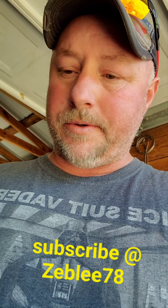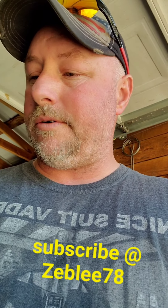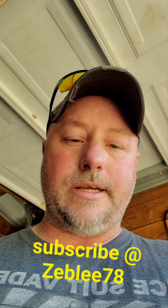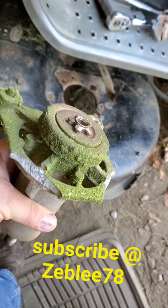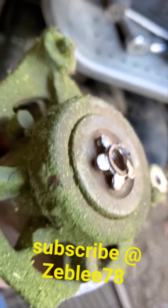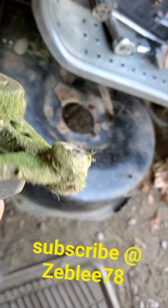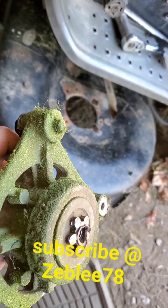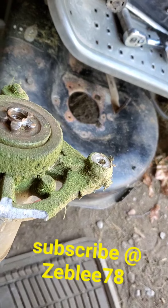So I'm gonna take this deck off and do some hammering around, add a little steel to it, redrill my holes, put a little longer bolts in it, and put a new one on. I'll show you guys this. Here's my piece that holds the blade on — where the blade goes on there, it's a little wore out. Two ears broke off. It looks like it was three bolts instead of four bolts holding it on, and I don't know why that was, but I'm gonna fix that.